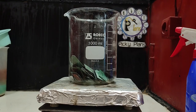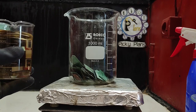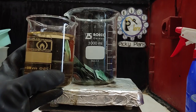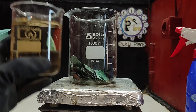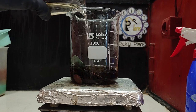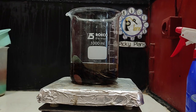To digest the epoxy, I'm going to add some sulfuric acid. This is 250 milliliters of industrial cheap sulfuric acid, it's 98%, but the color is a bit brown due to dissolved carbon caused by long-term storage in polyethylene containers. Let's add the sulfuric acid and turn the hot plate on to reach a temperature of 100 degrees Celsius and leave it for one hour or so to complete digestion of the epoxy and leave the gold bond wires